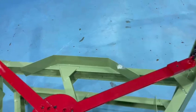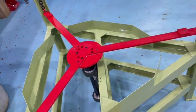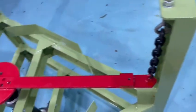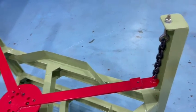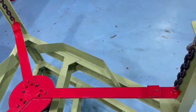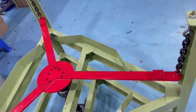The next piece to look at — if you look at this assembly, it's really very simple. The counterweight's not on there yet, but it just extends out from that hub. The next piece that's really critical is this main plate goes on here. There's an L bracket that holds this on, and we discovered that L bracket really has to be strong, so we went to a much, much thicker steel on that. Every now and then, because there is a lot of movement in this machine, if these bolts get a little loose on that L bracket, you'll hear a little tiny squeaking, and you'll notice that the machine will shake a lot more.